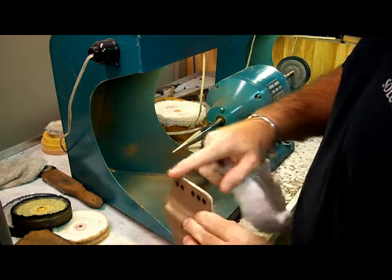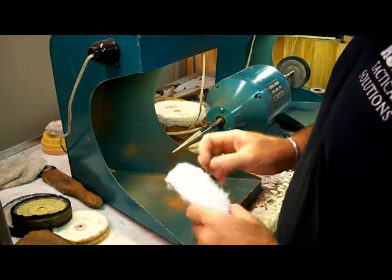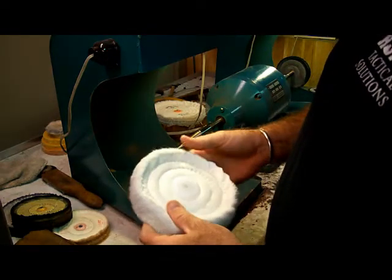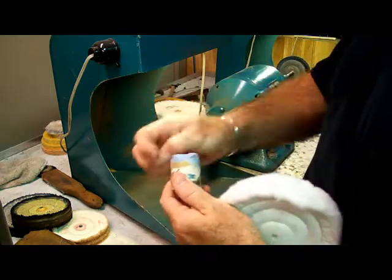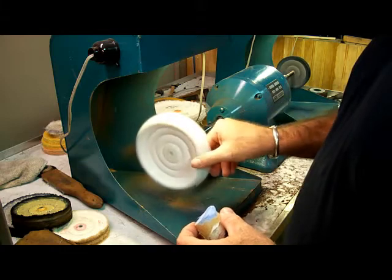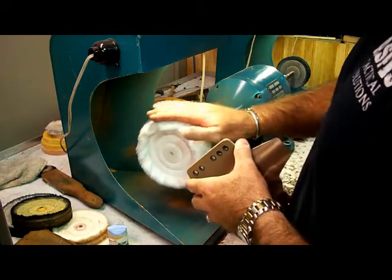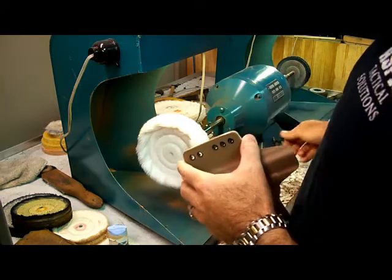Now you've seen what that looks like under a macro lens. What I'm going to do now is what I do with all of my holsters — this is a step you can skip if you want, but if you really want those buttery smooth edges this is really the only way to do it. This is a very loose soft stitched cotton wheel and we'll be using a blue rouge made specifically for plastics. I want to apply some of the rouge onto the wheel — only a small amount — and I basically don't want to apply any pressure with the Kydex itself. I just want these fibers to barely barely touch the surface, and that is what's going to give us our really shiny buttery edge.